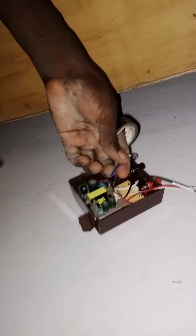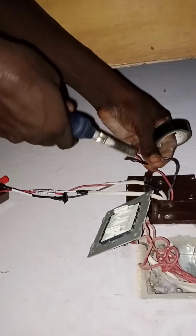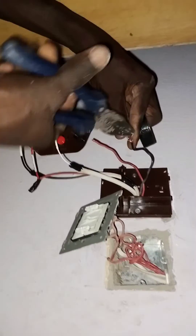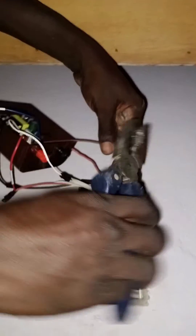You have to be very careful at this point so that you don't make a mistake. If you are new to my channel, please kindly subscribe — don't pass this video without pressing the subscribe button. So we've connected the remote control wire. Now we're connecting the AC live wire and the AC neutral wire — make sure you connect the AC live and AC neutral inputs properly.